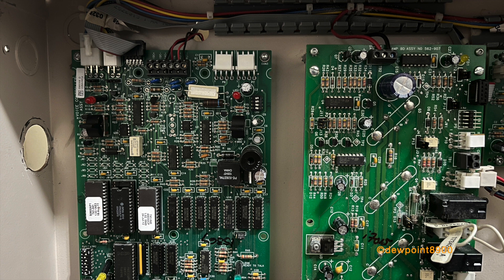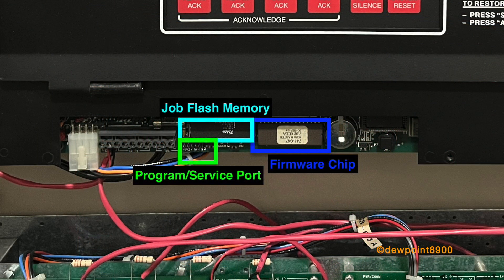This feature is only available with firmware version 9. Like the 4100 Plus and ES panels, the 4020 is programmed using PC-based software. There is no front keypad programming. The programmer is not openly accessible and requires a dongle and compatible PC to use. However, if you know someone with access to the programmer, a job file can be created and downloaded to the panel. The CPU board has a 10-pin connector for programming and service, also used to download a new job via serial or modem connection. The programmer version must be compatible with the panel's firmware and exec versions, or the panel will not operate properly. The latest firmware revision is version 9, recommended if you plan to connect this panel to a 4120 network.